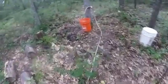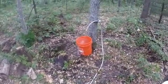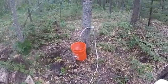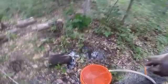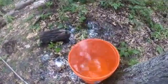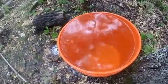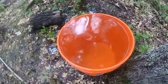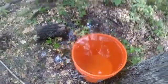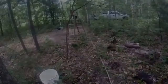On the output, I'm starting to produce enough water to where it's not seeping into the ground as fast as it was before — the water has been running for quite a while. If we look in this bucket here, move the water away, you can see there's just a little bit of sand, which could have been from not flushing the last bucket completely, but it's clear. The water is running clear. I think we've achieved our goal today of flushing the well, so I'm going to pack things up.